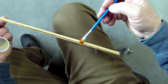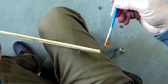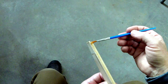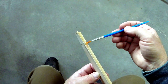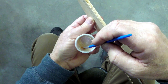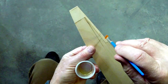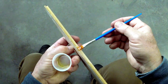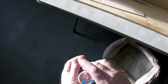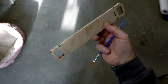I'm just looking for the wood to change tone a little bit. I'm sure you've seen that if you've epoxied before or stained anything — it'll always darken just slightly when it's wet. How far up here are we going to go? All the way, yes — we're putting the bullnose on now. Not right now, but within this epoxy session. As long as the epoxy still has a pretty good tack to it, fresh epoxy will stick to it with a very strong bond. Stick around to the end of the video before you start gluing yours together and you'll see my setup process once we start weighting everything.